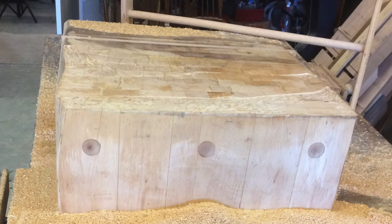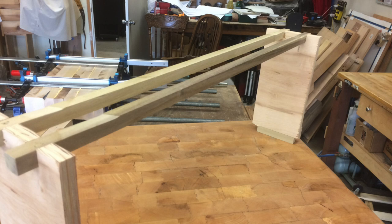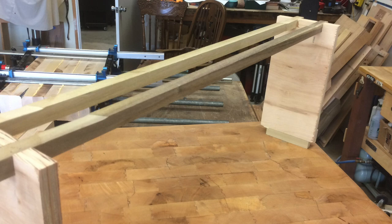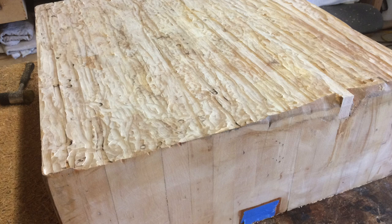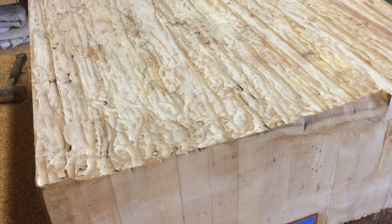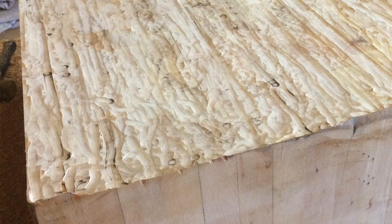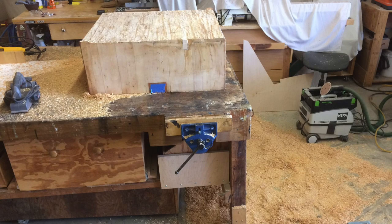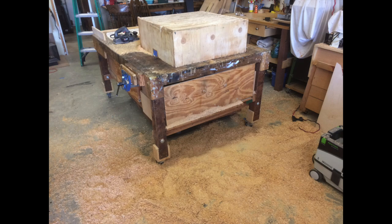In this shot you can see it's sitting flat on our workbench, but it's way up high on one side — this is the top. To deal with the top, we created a sled that we could run our router across. It's sitting on top of the butcher block itself, but this sled is meant to sit down on the workbench, and we ran the router back and forth over this thing. It takes a bit of patience, it takes that jig, and it takes a really good broom. In the end you wind up with something that's kind of carved and weird but mostly flat. Then it comes down to a power planer, a hand plane, and lots of sanding to smooth everything out — this creates a ton of dust.